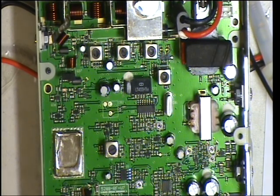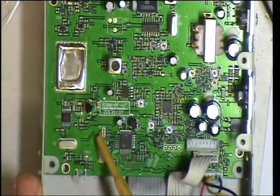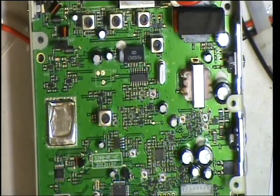I'll just check we're on frequency. There's one preset we didn't know — I wonder if it might be frequency, Mark. There's always one, isn't there? If any of you have got a service manual and know what W4 is, do tell us. We can't see how the frequency is adjusted. We can see where the 10.24 MHz reference crystal is, but there's no preset for that, which we find kind of bizarre.